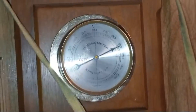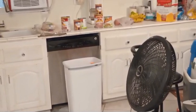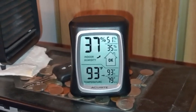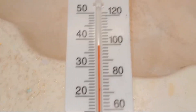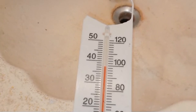It's 7 p.m. and still hot inside and outside. It's 98 degrees Fahrenheit outside and the swamp cooler is blowing in 82-degree air at 51% humidity. It's still around 88 degrees inside near the swamp cooler. Twenty feet away from the unit it's still 90 degrees at around 49% humidity. At the far end of the house it's 90 degrees, and the bedroom is 93 degrees at 37% humidity — the highest the thermometer has read since midnight. The uncooled room is approximately 100 degrees, so the rest of the house is around 10 degrees cooler. Today was slightly humid, sometimes cloudy, and extremely hot, but the swamp cooler did an alright job considering it is significantly undersized.